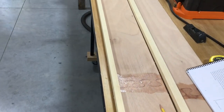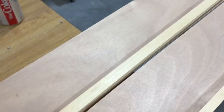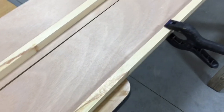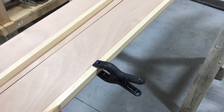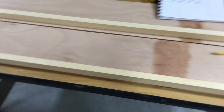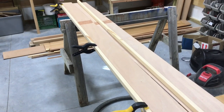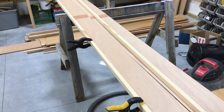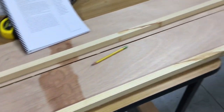I thought that's kind of silly. These shear clamps are three quarters by one inch, so when they go on there, they're going to lay on there like this one over here does — that's the one inch width, but that's the three quarter inch width. So what I'm doing is I just clamped the three quarter inch width onto the edge and I'm just going to draw the line using the three quarter inch that I've got. I did measure the board and it's exactly three quarters of an inch. So once we scribe that line on there, we'll know exactly where it's supposed to lay, and that'll cause the top quarter inch to stick out proud above the panel.